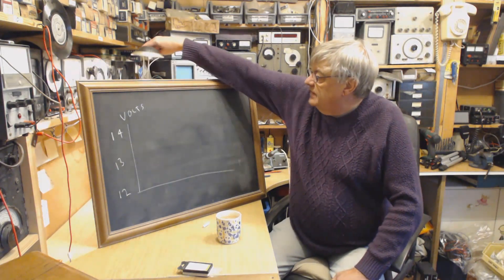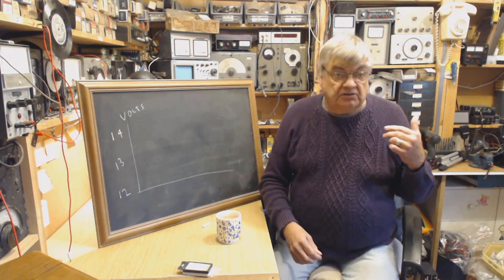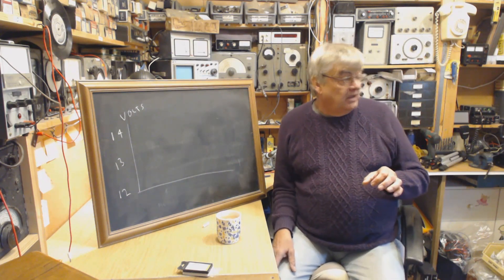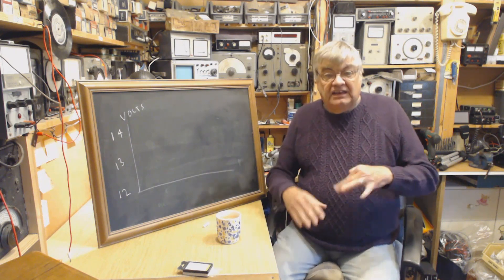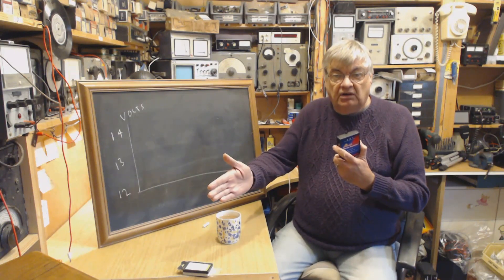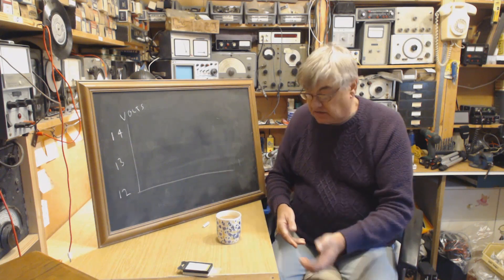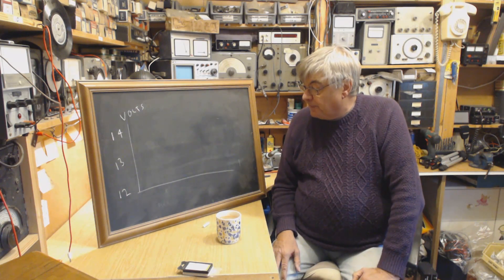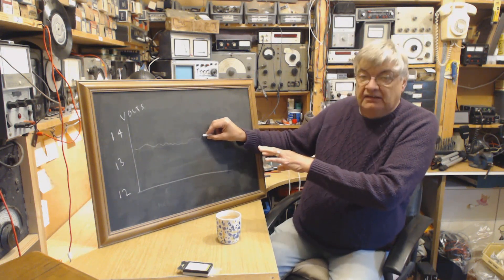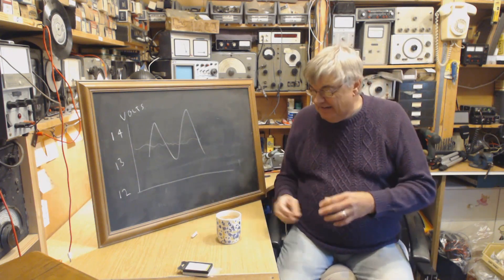I've now turned my bench light on, and my amateur radio gear over there, which is on 12 volts, and it's charging at 4.5 amps. So it is varying the charge, rather than this type where the charge is either on or off — there's no in between. That's the problem with the old one and many others apparently. What this is doing is sort of modulating to keep the voltage around about the right level, rather than on, off, on, off. You don't want that.